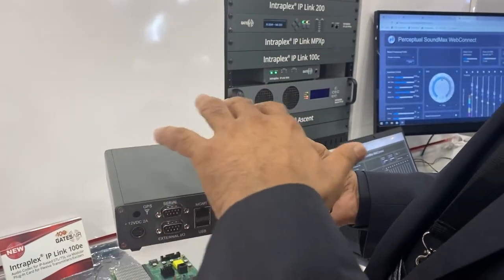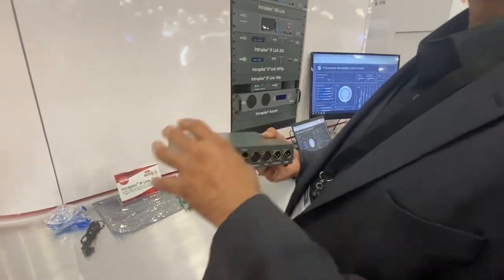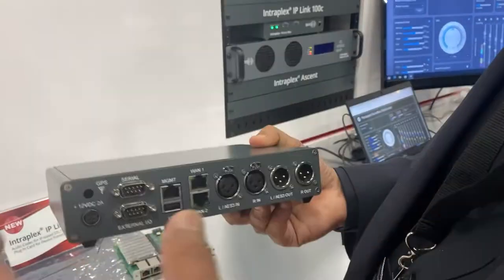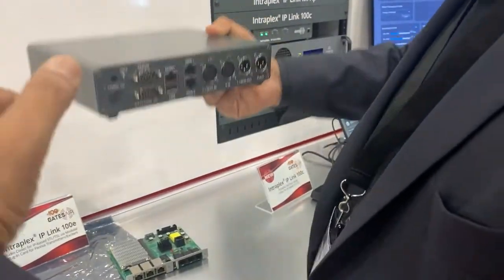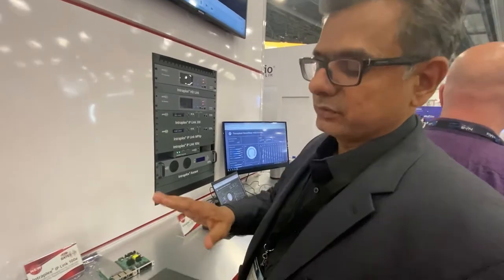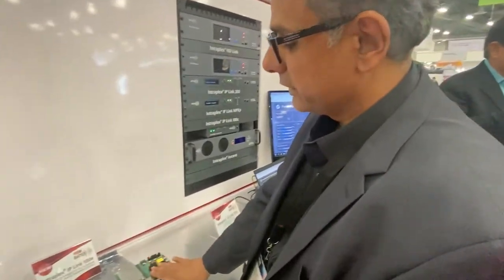It can also take in a GPS module for single frequency FM networks. We have patented technology that allows us to completely synchronize the FM main transmitter and booster so that there is no interference in the overlap region. Our patents provide that capability and are protected by that. Synchrocast is the name of the technology that's in here, as well as in here.